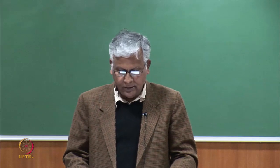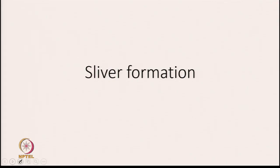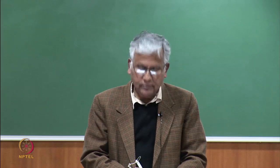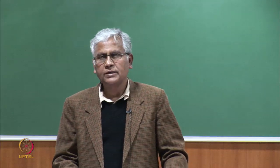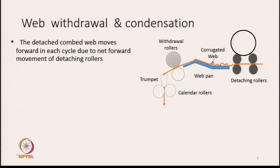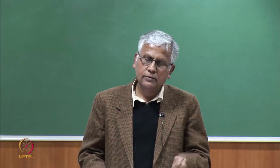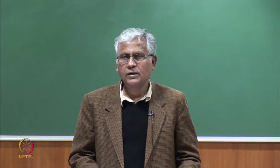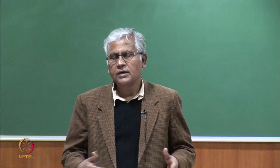So now, in this lesson, we are going to discuss sliver formation. In combing, what do we do? We basically comb the lap sheet, but the operation is discontinuous in nature. That is, we feed a little bit of lap, grip it, and then comb the forward part which is projecting out from the grip, and then we get a combed fringe. The combed fringe we take out and hold it, and the next fringe comes, falls on the previous fringe, and the cycle goes on and on.